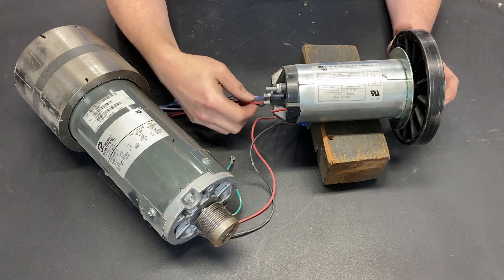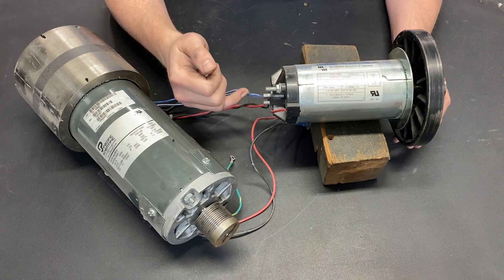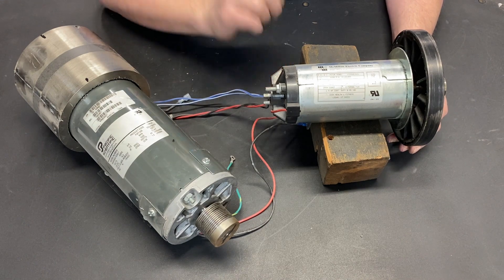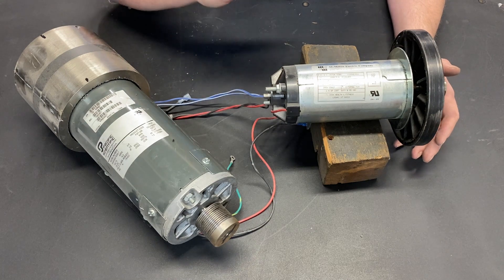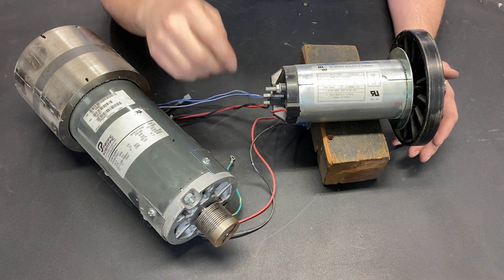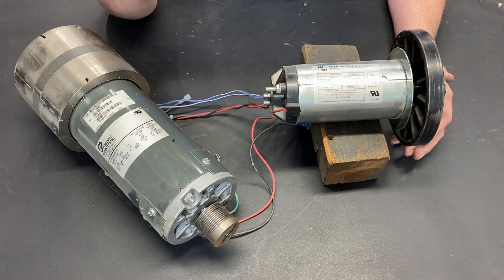The purpose of grounding is to create a path for electricity to flow to ground if there's an accident. If this red wire is rubbing up against a piece of metal and the insulation wears through and it is suddenly in contact with the body of whatever you've attached the motor to, and you touch that, you might get shocked. But if the body of whatever you've attached the motor to is grounded, the moment it wears through we're going to trip some breakers and everything's going to shut down. That is why we use green wires and we ground things.